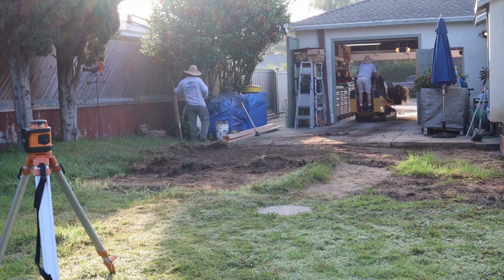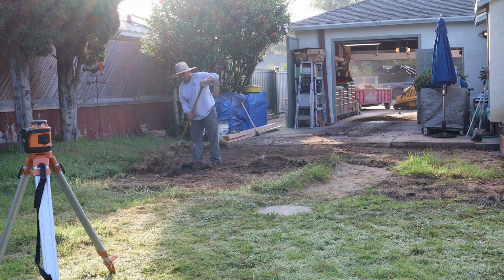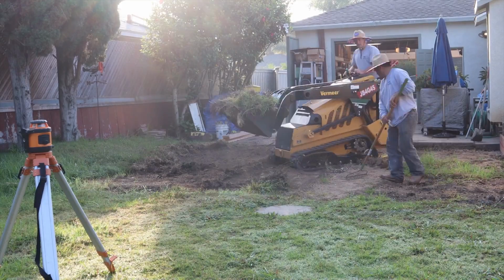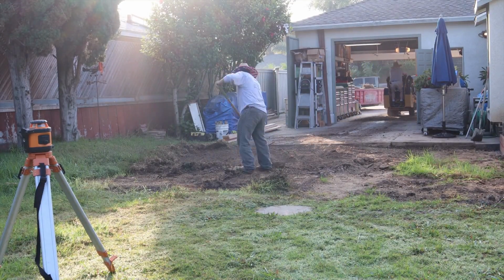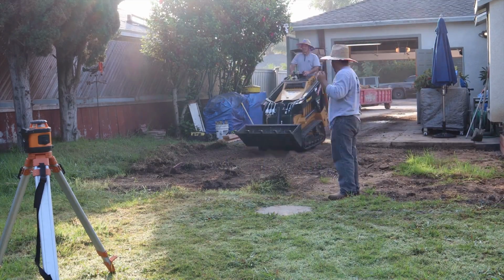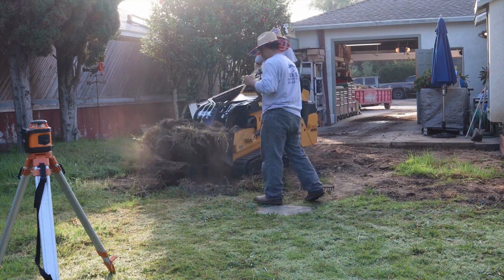We're going to use my usual rebar layout, which is the 3/8 rebar on 2-foot centers in both directions. And I'm going to also throw in a half-pound fiber for every cubic yard of concrete I use on this job.